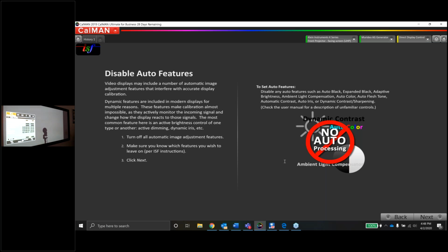So the color profile is, let's actually reset that. Okay, so the color profile standard. The color temp, 6500K. We've got the gamma. MPC level, let's go ahead and make sure all this is turned off. The 4K E shift, unless somebody has any objections to this, I think we can leave that on to do the calibration. I don't see why not. Let's see here. What else do we got? Original resolution is auto. That's fine. Blur reduction and things like that. That's off. Great. And then we just have contrast, brightness, color, tint.